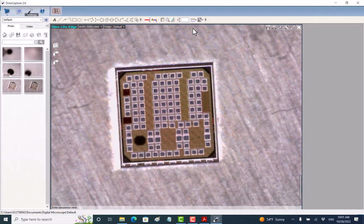Why I know this is the one? Because I can see a big pad. This is actually the resistor. This is something I want to show you in the class: for a semiconductor chip, you actually don't want to have a resistor, because this resistor is only about 100 kilo ohm. You see, it occupies so much area. Think about this whole thing, it is 6,000, although you have 100 die. So this one is occupying maybe 1/20th of the area. So that is a lot of money, right?